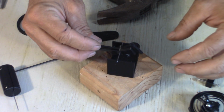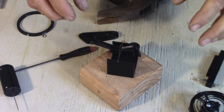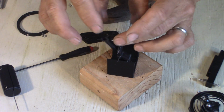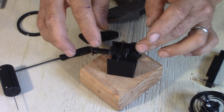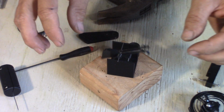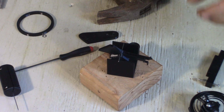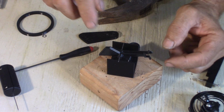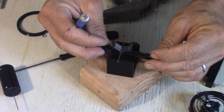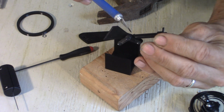The last thing is test the balance. Ideally, it would be nice to have it totally balanced, to have a good timekeeping or position. That all depends on the printing settings, how much layer and infill, so yours might not be perfect, but that's close. What you can do if you really want is put some hot glue or take weight off the heavy part, so like it would need a little bit more weight on this side coming up.